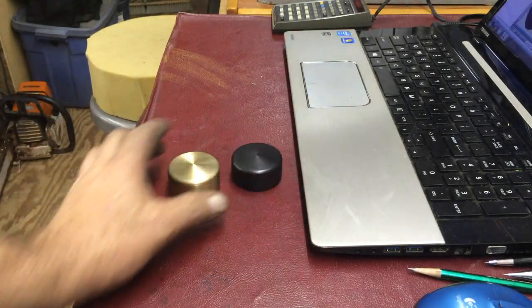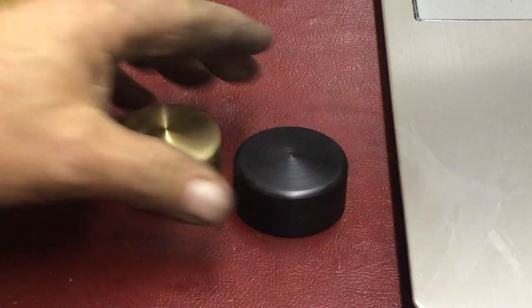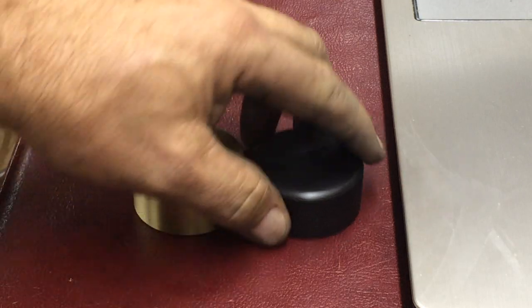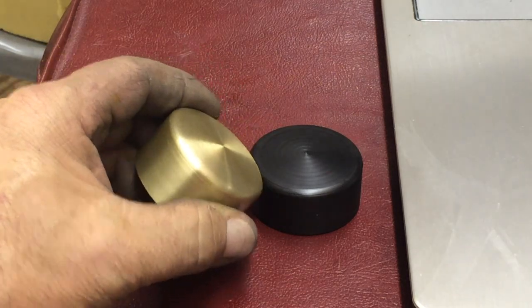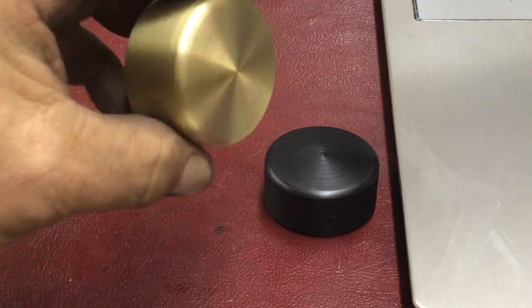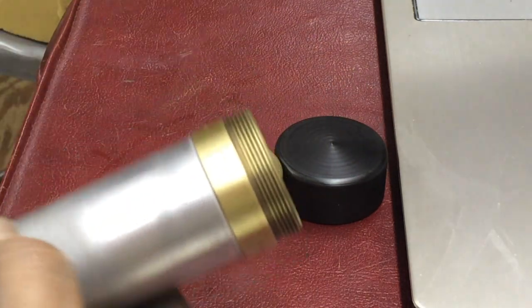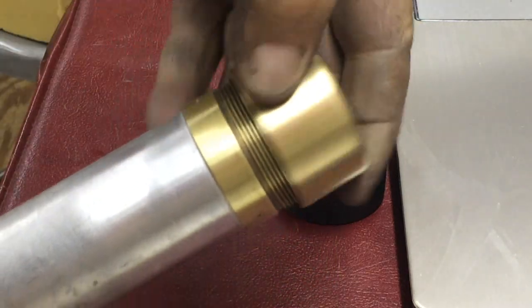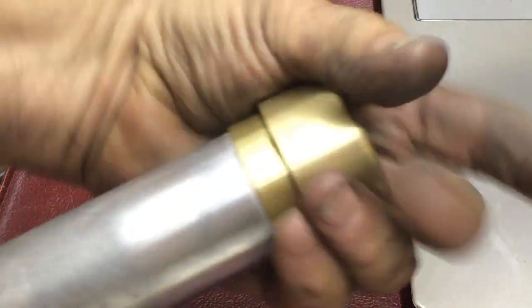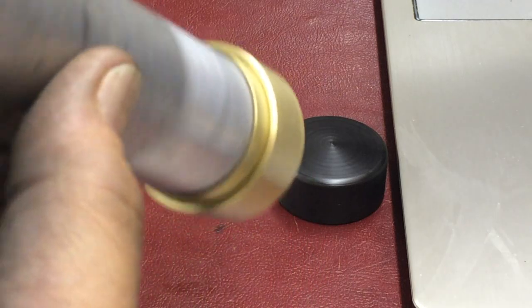So there's two caps right there. They both came out really nice. This is the prototype one. This one I made just a little bit longer - it looks a little better, I think. And it's got some weight to it. A little dirt on the inside, anyway. Came out really nice. That's just a little Scotch-Brite finish. Very happy with it. I cleaned up and buffed up the end of the tube, both ends - the threaded end and the base. Just like it was made for it. Absolutely perfect. That close tolerance fit there on that counterbore - man, that came out good.